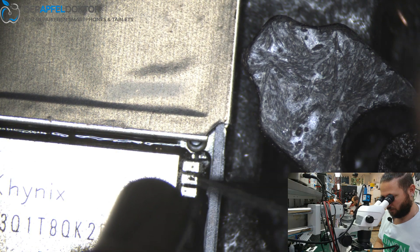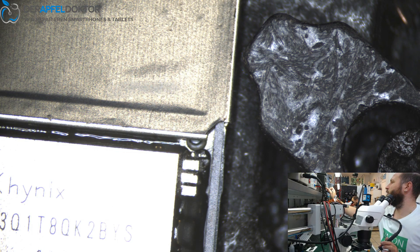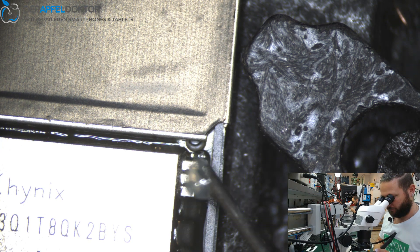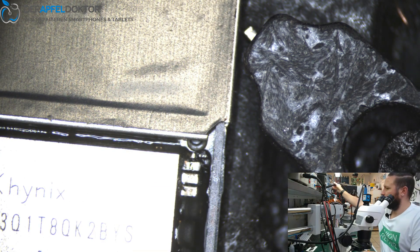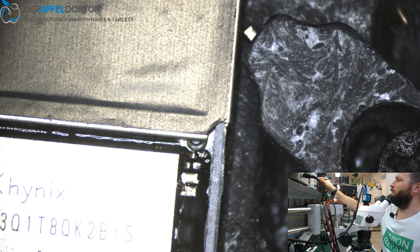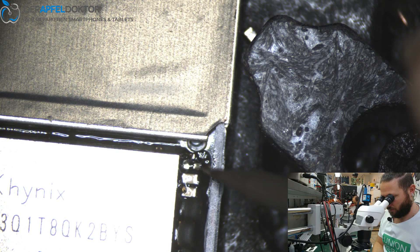Slightly get away the overfill and have a look at the other caps sitting here. Get it out — get some more heat, don't want to rip any pads. Get some flux, and there we are. Get some more flux there, then take the soldering iron.